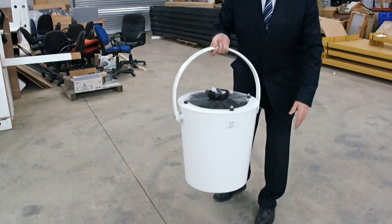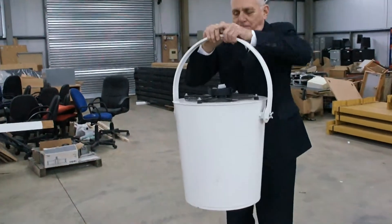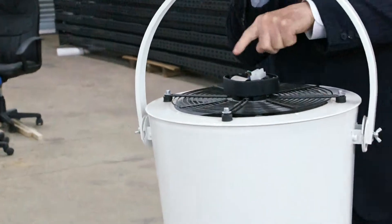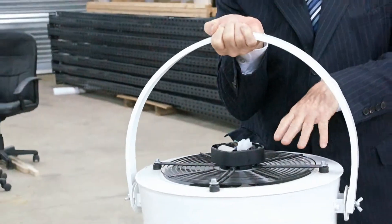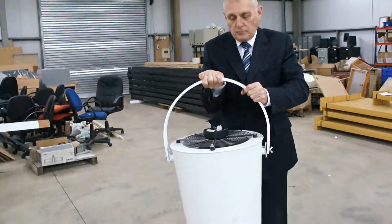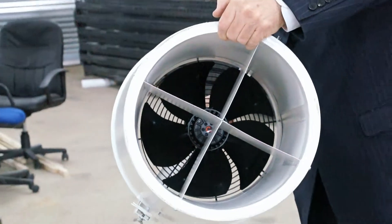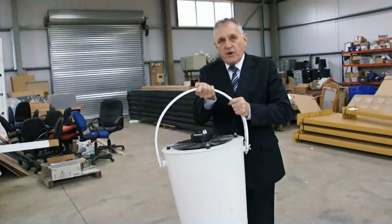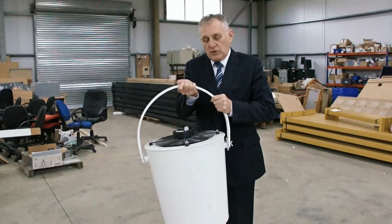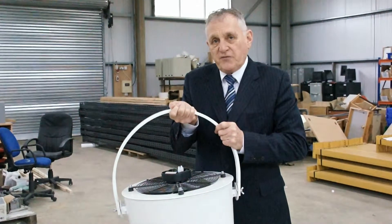So what is a destratification fan? Well, we have an example of one here. As you can see, they're not too heavy and they look a little bit like a dustbin. On the top is a controller, and this controller will vary the speed of this fan from almost nothing — which means no revolutions — to about 1350 revolutions a minute. If we look at the bottom end of this, you can see the fan. It's a variable speed fan controlled by something called an EC motor, which HeatingSafe provides an input of 0 to 10 volts to determine whether that fan is at 0, not going round at all, or at 1350 revolutions a minute.